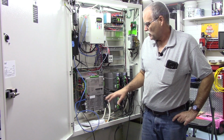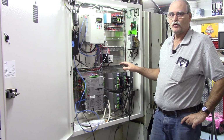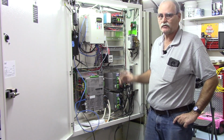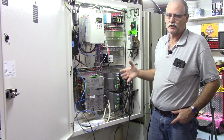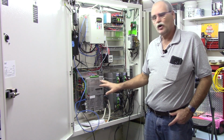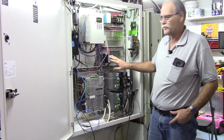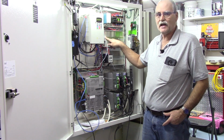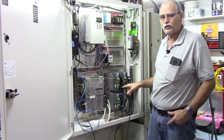in the cabinet. I see a lot of DYN4 users going a little bit overboard with contactors and filters, line filters and line reactors and all that stuff. When you're talking about a kilowatt and less, I don't personally believe you need all that stuff. I followed the Centroid generic schematic for Oak, and they have a number of them that you can refer to, which basically calls for one large contactor that's capable of the current that the drives are putting out. And then I used one line filter to feed the logic input to the DYN4 drives.